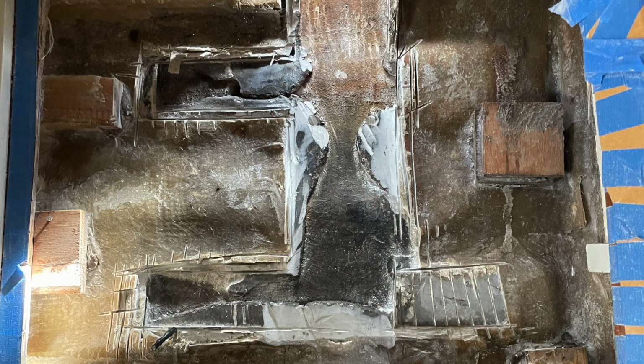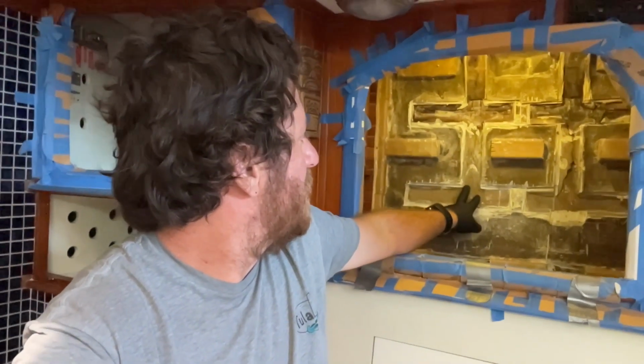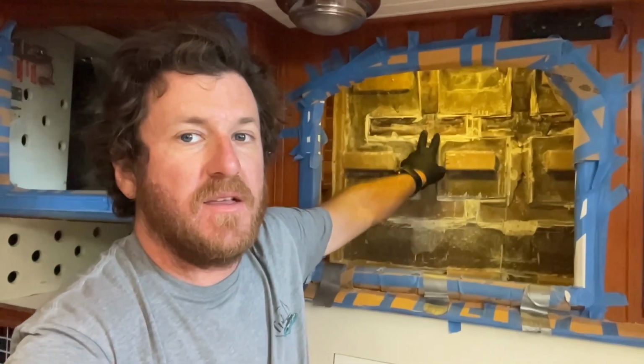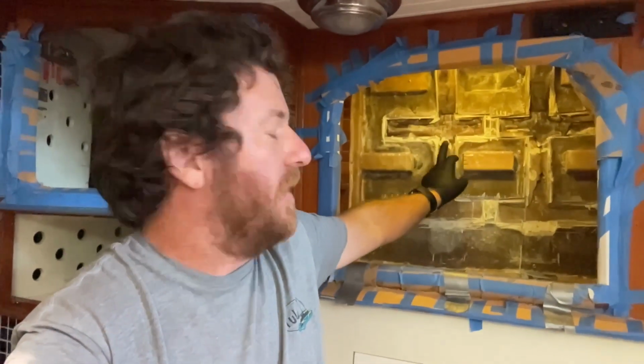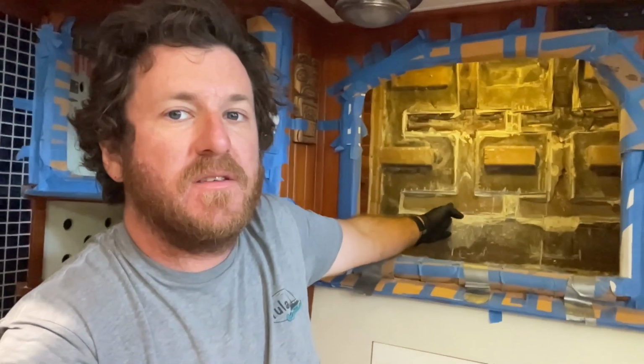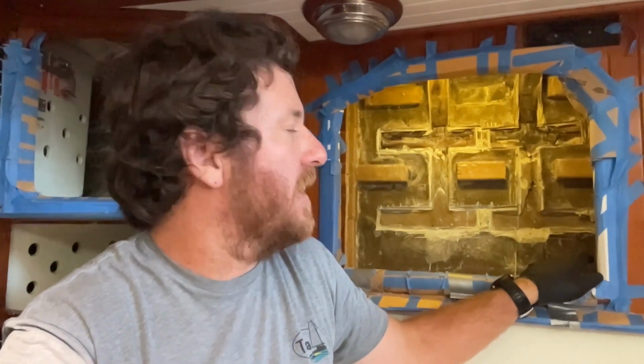We are here. We have the chain plates removed. The fiberglass has been cut down, and these exposed areas are where the chain plates are going to live. We're just going to have one single arm down with more bolts in it going through with a backing plate. So these extra H pieces or wings are going to be filled in with Dynaglass. So tomorrow Sergio can come down and fit the angles and the bolt patterns. I'll put those plates back on, fill behind those so they're nice. They have a lot of surface area to touch, and we'll drill through the hull.